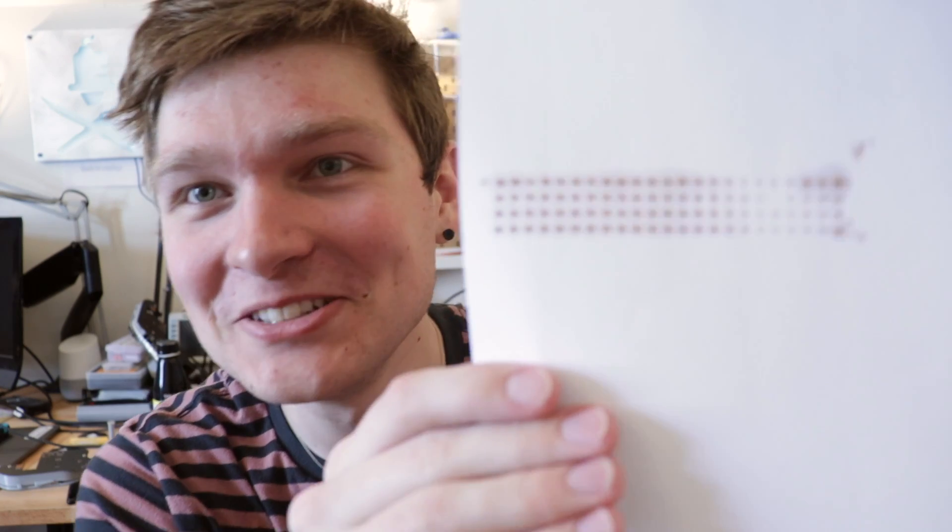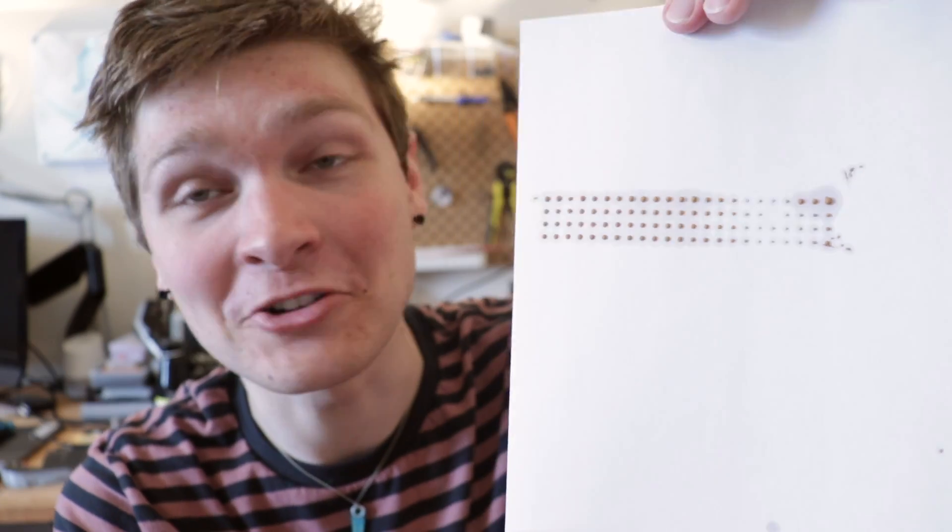It does the thing! Look at these beautifully neatly spaced dots — I never thought I would be so excited about a grid of dots. You can see every one of these rows was a different version of my g-code: kind of too bulgy at first, the first bead was really big, then retraction was too much and not enough paste was coming out, and then I slowly started to nail it in. They're still just a tiny bit too big — I want them to be a touch smaller — but I think that's very achievable. If I get a smaller nozzle tip, which are coming in the mail right now, and switch from almond paste which gets runny when it warms up, I'll almost definitely need to change all my settings to tune it for solder paste.